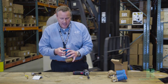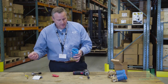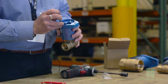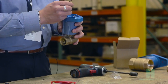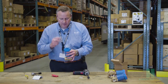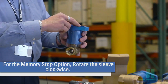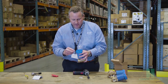Should you require the memory stop option on the valve, that's simply done and can be done while the handle's in place. Simply loosen and remove the allen screws, and by rotating the inner sleeve clockwise, the memory stop button will protrude between the stops on the valve.